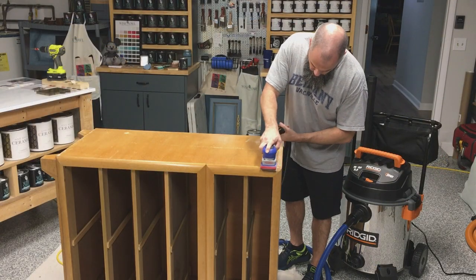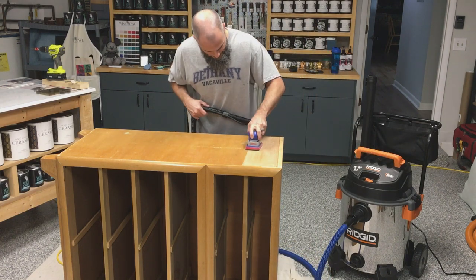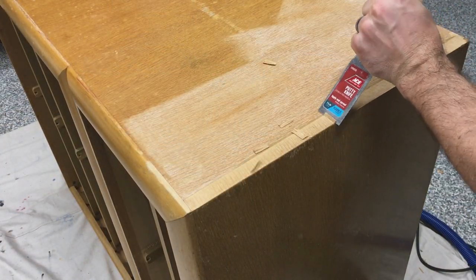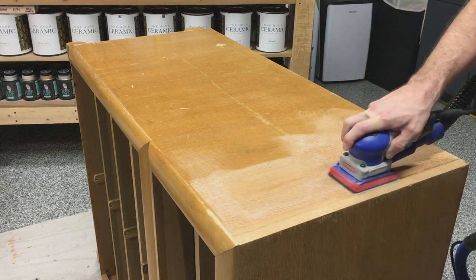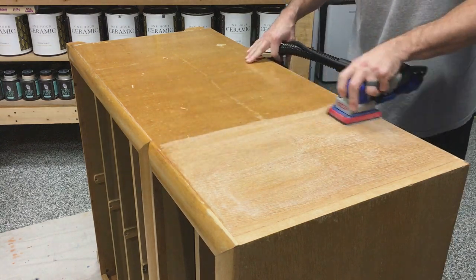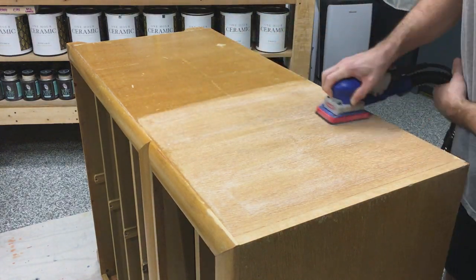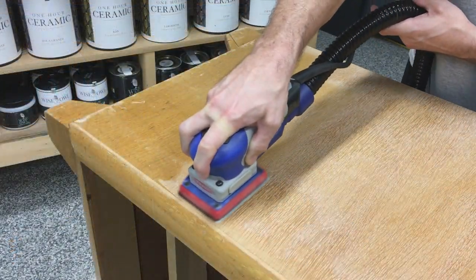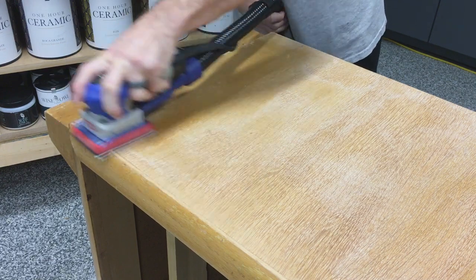I got so much work done that I would have had to take inside and outside repeatedly between sessions instead of just working for a half hour here, half hour there without worrying about moving the piece in and out. There was one little part where the glue was failing and raised, so I just popped it off and sanded it even. The varnish on here was failing pretty well, so I decided to sand it back regardless of what I ended up doing with the piece.